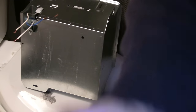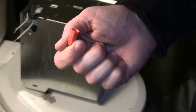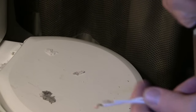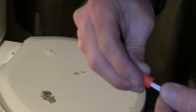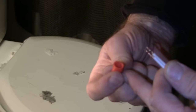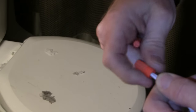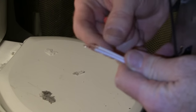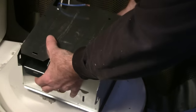Also, you're going to want these little electrical connectors — wire nuts. That's what you're going to use for connecting your wires. Twist the wires together, put them in, and screw this down on top of the wires. Pretty simple. Once you get two wires twisted together, you'll put your third wire on there, and this just goes on top and you screw it right down until it's tight. That's what you're going to use to make these connections. Make sure there's no bare wire left once you make the connections — you don't want bare wire hanging out. That's not going to be good. You're going to short out your system and cause all kinds of problems.